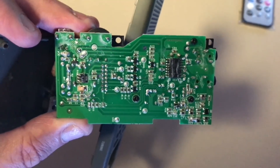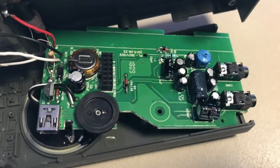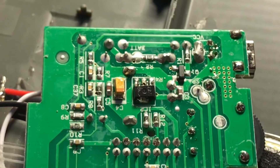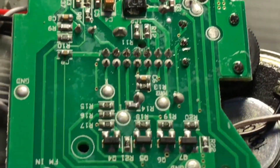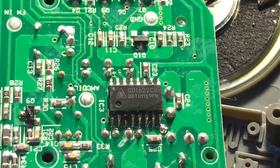This looks like largely the audio amplifier board, covered in that white crud you see from China products. There's the real-time clock battery backup, and the back of the audio amplifier with all the capacitors there. The soldering is of varying quality, sometimes a bit frosty. I've cleaned this board up a little bit for the camera work — I don't know what that white stuff comes from; it leaches out with moisture from solder joints or something like that.